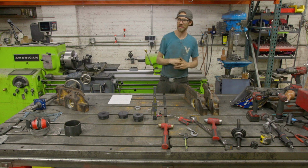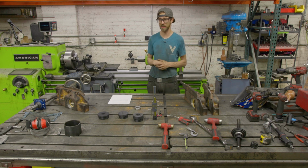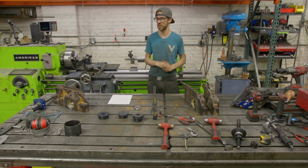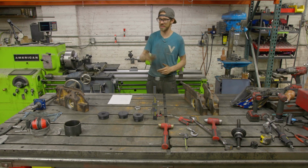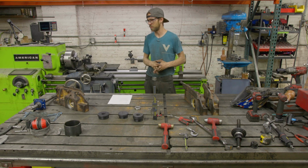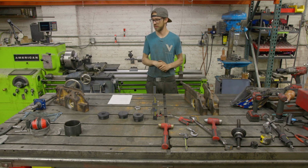And then lastly, we used the radial drill. The radial drill, like we talked about, it works, got the job done, but there's just limitations in rigidity and, on mine, feed rate. Doing it up and down is nice, but all the debris keeps falling down. So it may not be a problem with a better bar, but it's just maybe not the most ideal.